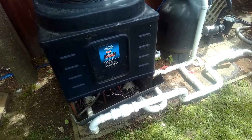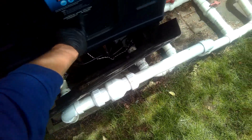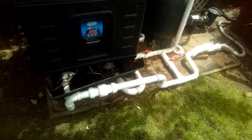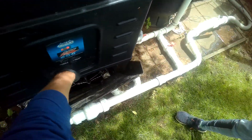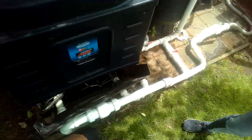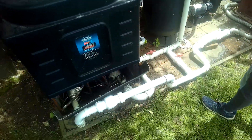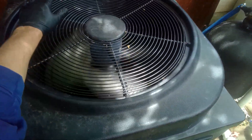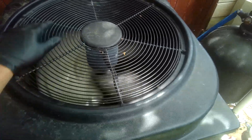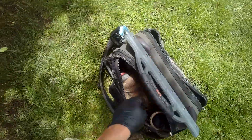We are working on this 100% pure titanium heat exchanger — this Aqua Pro 1000E/1100E heat pump that the customer says is not working. I have the condenser fan running right now. The thing is wobbling like crazy, but the whole thing wobbles actually. I do not hear the compressor.